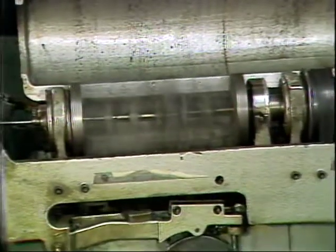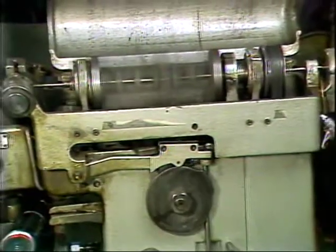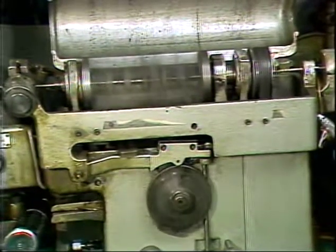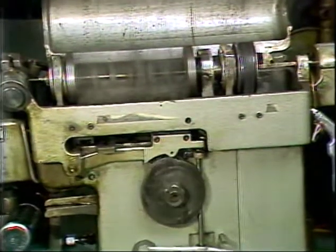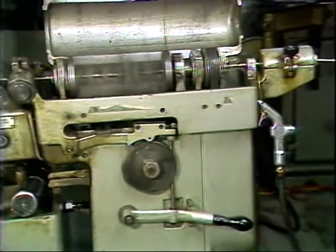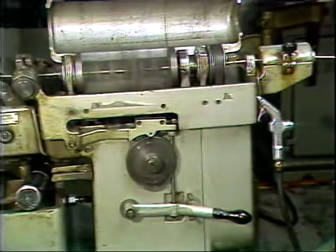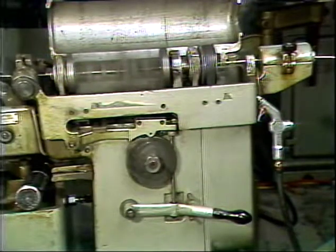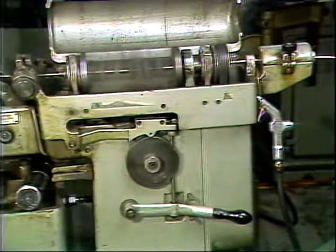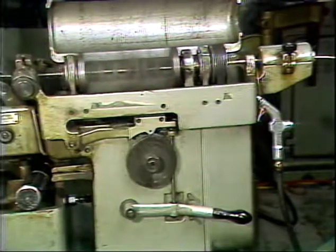The stock straightener camshaft can run at two different ratios, 1-to-1 and 2-to-1. The 1-to-1 ratio is most commonly used. This means a stock straightener camshaft will make one revolution for each revolution of the main camshaft. A 2-to-1 ratio means that the main camshaft will make 2 revolutions for each revolution of the stock straightener camshaft.